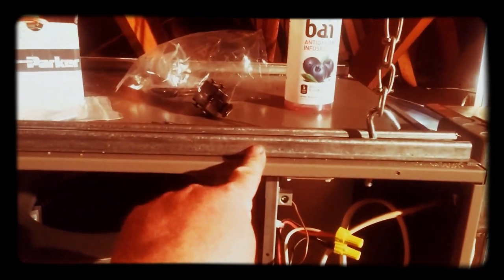For the most part, what we do is we use our Unistrut here, for the simple fact that because Lennox is a two-part cabinet, it's got this joint here in the middle. The only thing holding that joint together are these plastic inserts that go in quite a ways, and you've got a screw here, a screw here, and then two on the back side holding it together. So what happens if you don't have the Unistrut on it, it tends to want to break and fall down once you take the doors off, and it makes lining up the doors very hard.